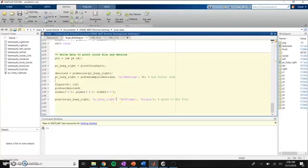Mesh creation was a unique challenge for my scan because my object has internal geometry. First, to import the data into MeshLab, I needed to convert my data into a point cloud format. To do this, I used the pointCloud function. Next, I denoised the data with the pcdenoise function to help prevent noisy data from throwing off the normal calculations. Next, I used the pcdownsample function with a box filter size of 5 to further denoise the point cloud. Then I exported the data into a .ply file.